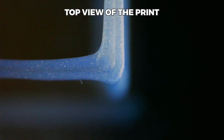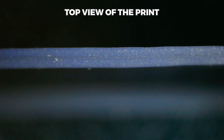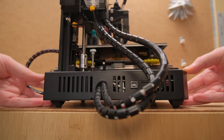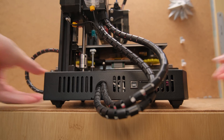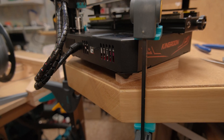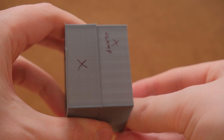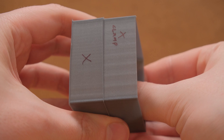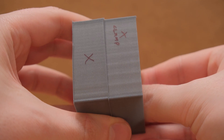Same with the other test print — this one helps you see the problem a little bit better. The line here looks like it was drawn with a 3D pen. You can truly see how bad it actually is under the microscope. You might think that having soft rubber feet would make the whole printer move back and forth more, causing even more wobble. To test that, I literally clamped the printer while in cantilever mode and printed the same file. The results are really interesting — the depth of wobble is just a tiny bit smaller, but it continues along all the print surface because the vibrations are not dampened, which makes the print look even worse.